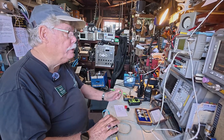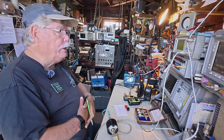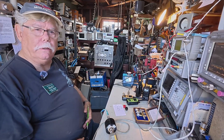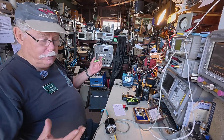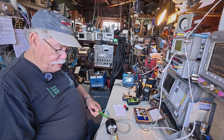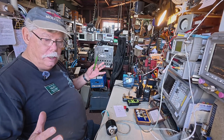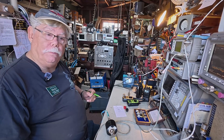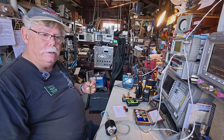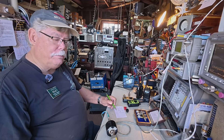This is a lot better reading — 31.3 dB, which is a lot closer to the 30 dB that I know this thing has. And that's based on frequency; it apparently doesn't like the lower end. One of the things you have to do in power measurement is the distance of the line between the generator and the measuring thing. If it gets to a quarter wavelength or eighth wavelength of the frequency you're at, it'll throw everything off and your power meter measurements will be worthless. You get into microwaves, the connections between the amplifier and the exciter can tune your amplifier and cause very interesting effects.